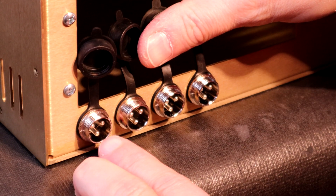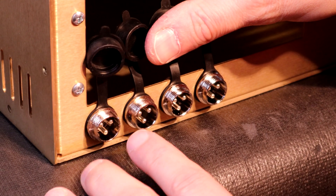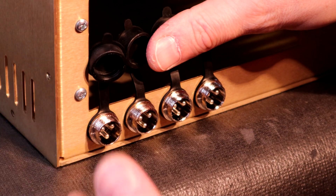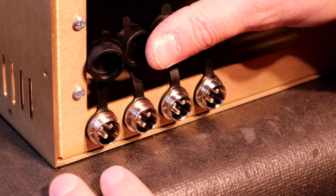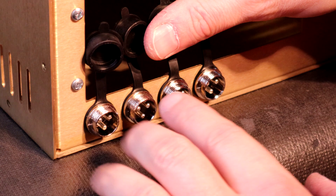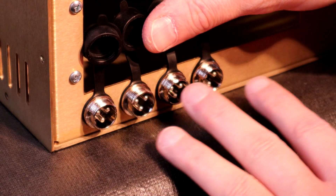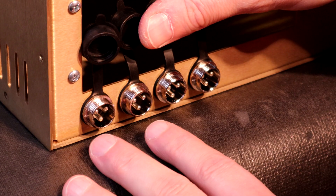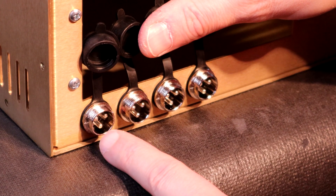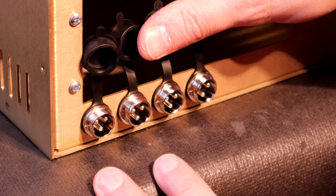Why I'm using 3-pin GX16 connectors is for switch allocation. When I say switches, remember a touch plate is also a switch — that's really all it is. Your contact is your end mill; your end mill makes contact with your base plate and you've got a switch. Any of these four GX16 connectors could be utilized for anything you'd like. The G540 has four available inputs, so you could do all switches on those inputs, with three additional jacks left for whatever you choose.